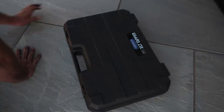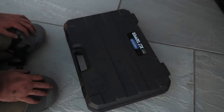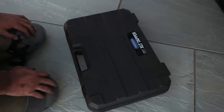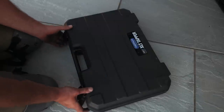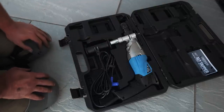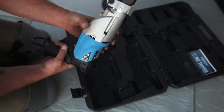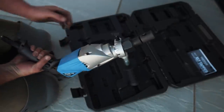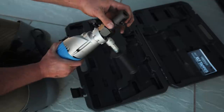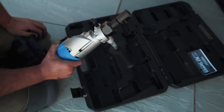This is a Champion XLT tapping drill, and I've seen Jason from Fireball Tool use this a couple times, and that's actually where I got it. You can get it other places. He doesn't make them, but I thought his price was pretty good. And this is a drill specifically for tapping, and the thing that makes it cool and different than just using a regular drill is it has this floating head. So if you're not going perfectly square, it might save you from breaking a tap. And then also it has auto reverse.